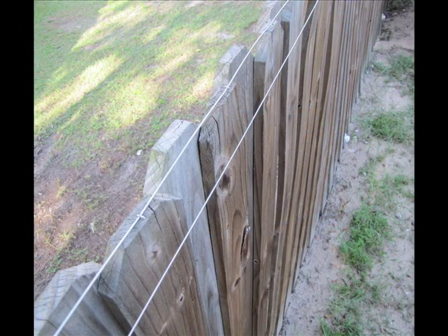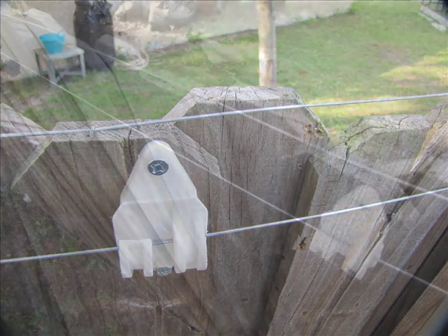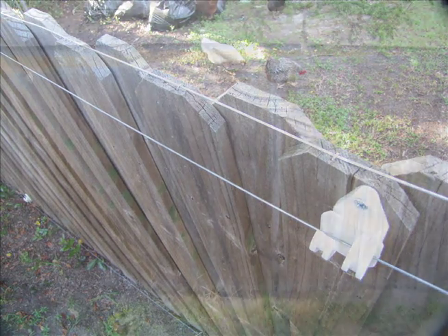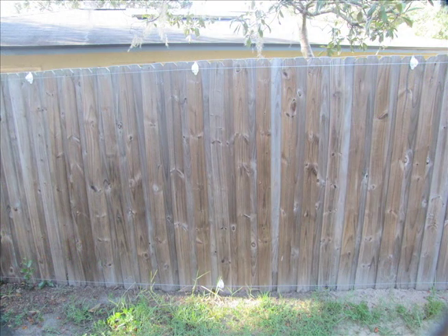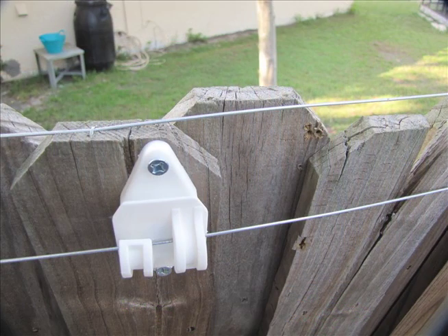Look close to the top of the fence and you'll see a third wire stapled to the top. This is a grounded wire. It's important because an intruder wearing rubber shoes could be well enough insulated that they don't get much of a shock, or if a shorter person jumps and grabs the top of the fence to climb over, they're not grounded at all — and the wood of the fence is a pretty good insulator. By having that wire across the top of the fence, you ensure they're really well grounded and they're definitely going to feel the shock when they grab these two wires and the high voltage pulse hits them. The design is simple and effective.